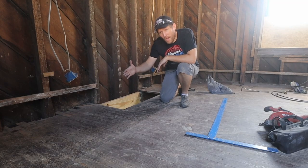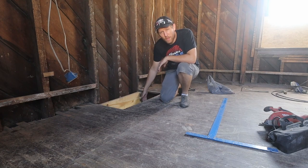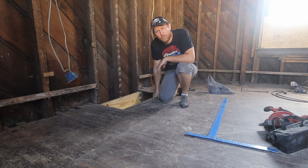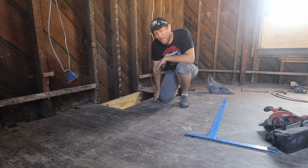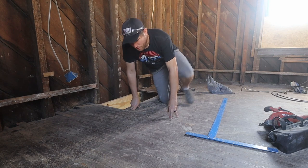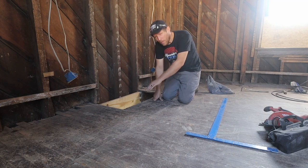is kind of the only way to make the section that you replace completely disappear. Obviously, one way would be just cutting off the boards right where the joist is and closing the hole up that way very simply. But of course, at that point, you have one long-running seam through the floor, and that might not be the most attractive, plus also not the most stable, as the tongue and groove doesn't go into each other.